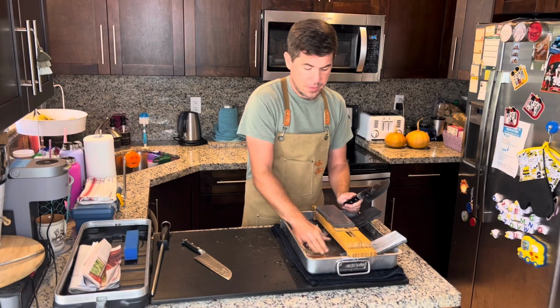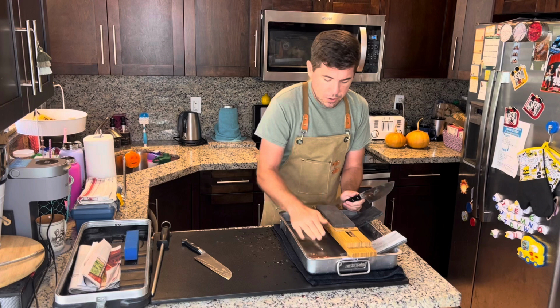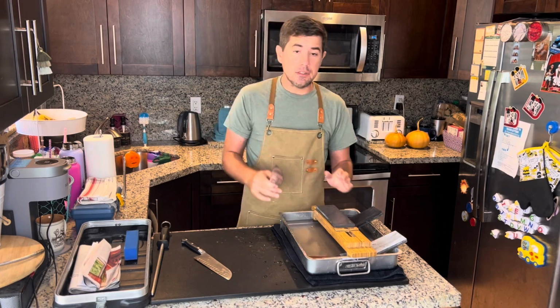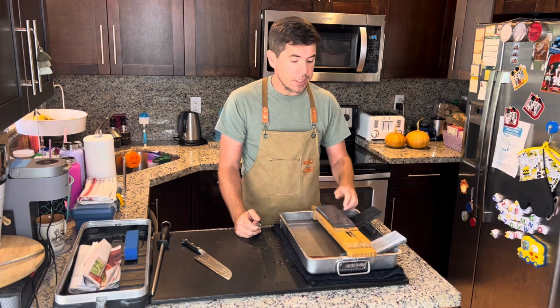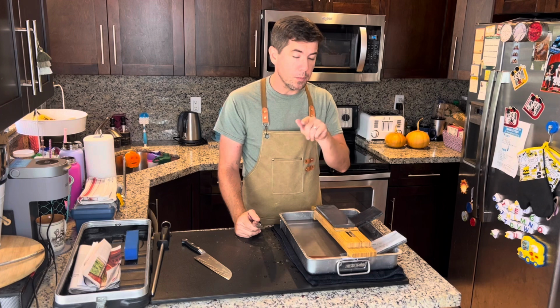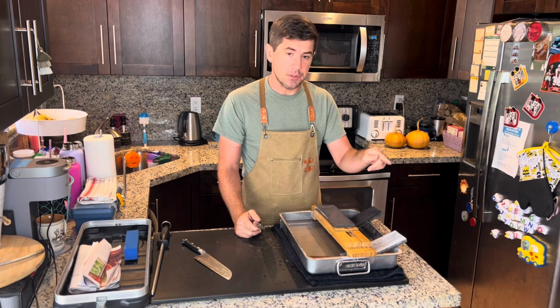All right, I'm gonna clean it a little bit more with some water. All right, and at this point, I don't need to look for a wired edge anymore. So all I need to do is just basically do the countdowns again, starting from four, working my way down all the way from three, two, to one, okay?